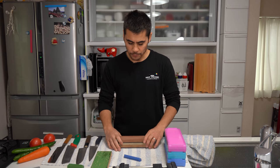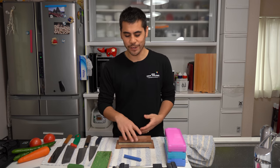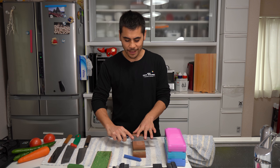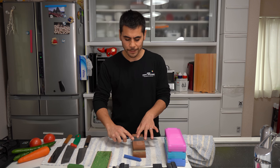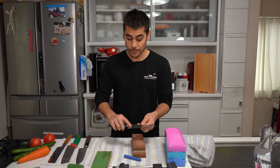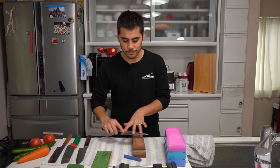And so when I was sharpening, I was doing them, you know, manually. I was looking at hours and hours and hours of videos about sharpening. And the key about sharpening is that you want to have a consistent angle. A lot of knives nowadays have a 15 degree angle, but whether you put it at 20 or 10 or 15 or 17 or 16, from what I read, most people say it's most important to get a consistent angle. So you have to keep it at whatever angle you choose.